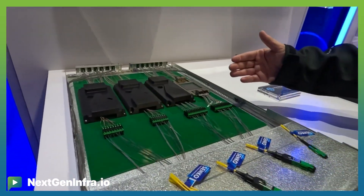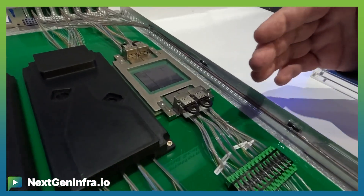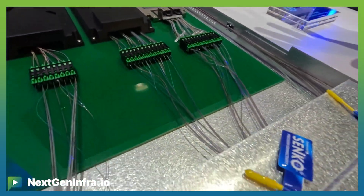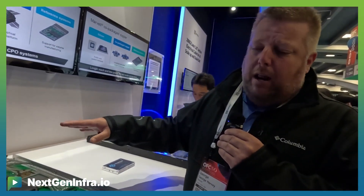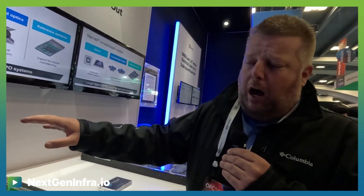Here we're showing the conceptual solution of leveraging our XPU ASIC directly with our CPO engines. This allows us to disaggregate the compute across multiple racks and enable higher-scale clusters. As an example, you could put 128 of these GPUs per rack and then have a 1000-node or 2000-node scale-up cluster with a single layer of switching. That's enabled because the optics give you the freedom to go anywhere within a row at low loss and low power.